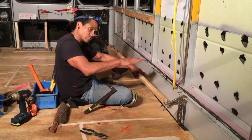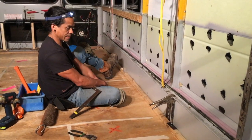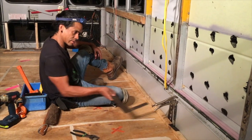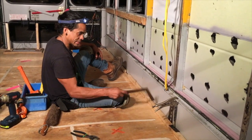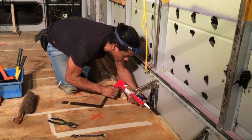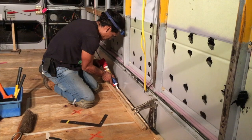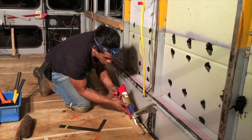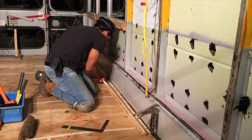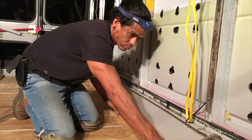We are basically overlapping it with the plywood so that the middle of this board is between two boards. I already pre-drilled holes — there are three here that I'm going to go against the metal. Once it's set, I have these here that I'm going to drill into the wood only. First thing is liquid nail, so I go ahead and set the glue, put it on the plywood on the bottom and on the side of the actual baseboard. I press it up against the other baseboard that's already set and lay it into the corner.